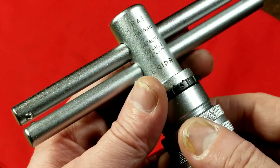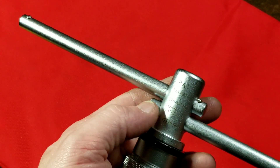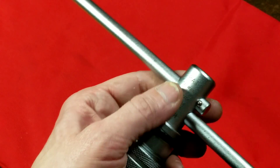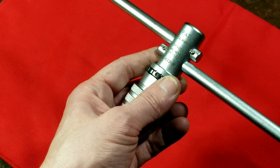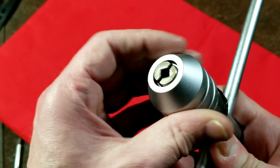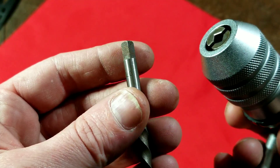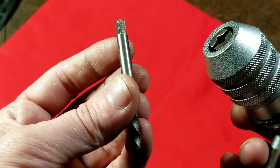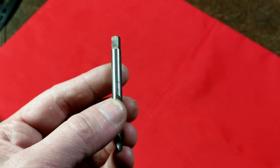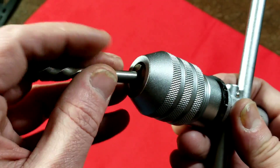At the end of this video I'll take it apart so we can look at the ratchet mechanism. It has dual T-handles and they both have ball detents — spring-loaded friction balls so the handles don't slide back and forth. This works with taps as well as screw extractors. Screw extractors are similar to taps — each size extractor has a square drive in relation to its size, and they don't follow standard increments, so you really want an adjustable wrench like this.